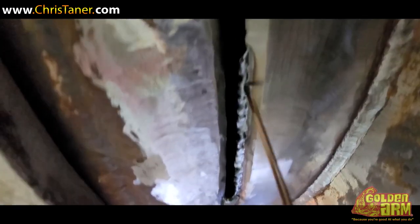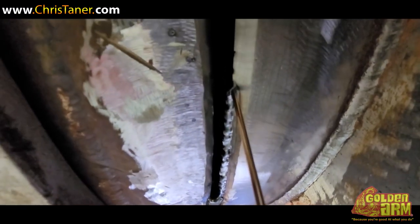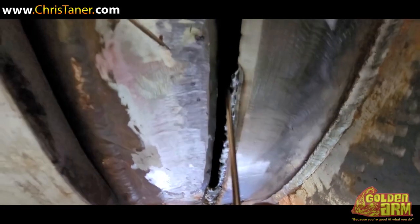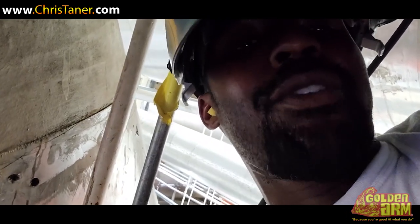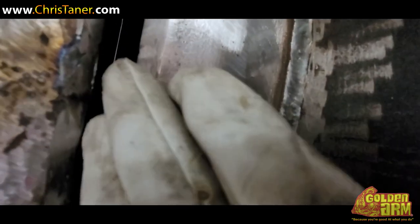So in order for me to close this gap, I have no choice but to run a bead along the edge of the bevel, like you see right here. This is where I stopped, so I'm going to carry this bead all the way up and just continue to do that — all the way up — until I get this gap at about one-eighth, then I'm going to go with it. It's going to be ugly, but hey, it is what it is. It's not my choice, not my call. They've got to have it done, and this is how they want it done. You can see how the gap is getting smaller and smaller, as opposed to way up here how big that gap is. That's an extremely wide gap and my hand can fit inside the band. This is how I'm closing it up.